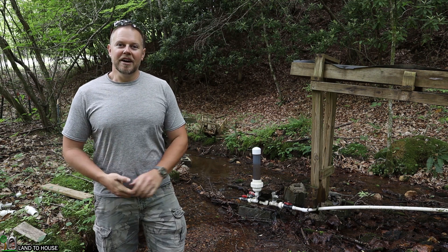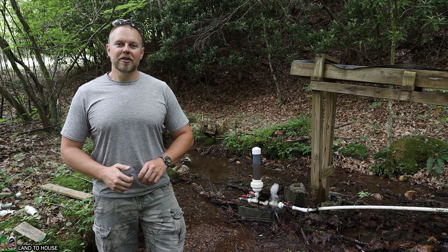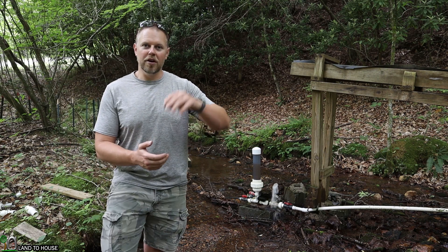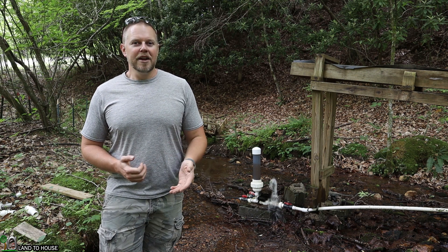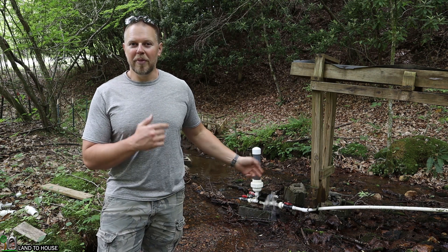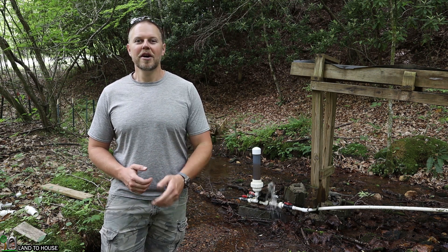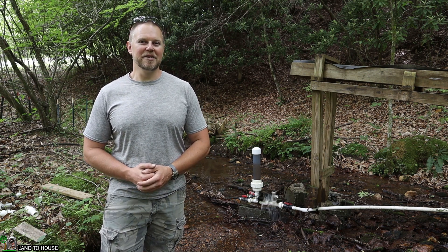So definitely close off your valves, open your pump, let that pressure tank drain out, hook everything back together, and I think you'll see much better results. In my system, I had a crack in the cap and that's what allowed all that water to build up and all the air to escape. You probably won't have that in your system unless the cap has frozen and cracked like mine had over the past year or two. If you want to check out my pre-assembled or ram pump kits, I'll have links in the description down below. I'm Seth with the Land House Channel and I will see you in the next video. Bye.